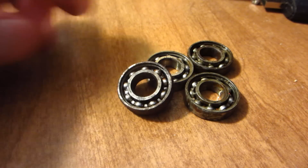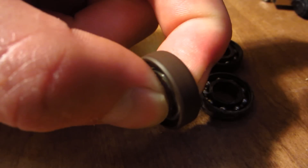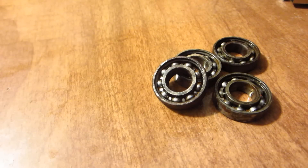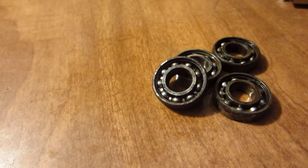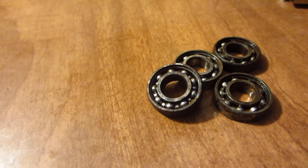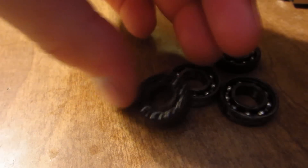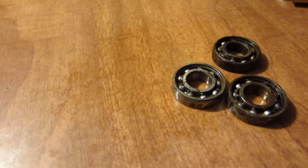This bearing — well, all these bearings but one — was really bound up. I'm not quite done yet, but they're running reasonably well, considering. I figured I'd talk about what I had to do to clean them up, and then talk about the effects on the bearing and why isn't this a good bearing anymore. It seems okay — if you couldn't see the rust, you wouldn't really know, would you? It's obviously dry so it's loud, but you wouldn't be able to tell if it had grease in it.